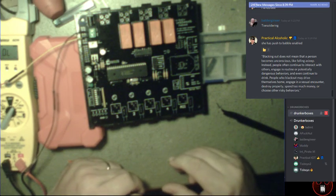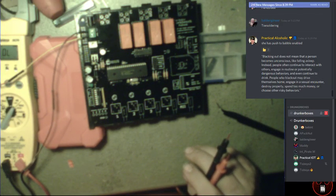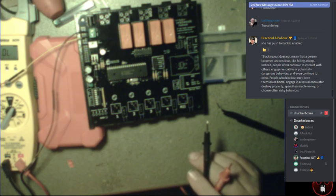And the antennas are based on the wavelength. So the longer the wavelength, the bigger the antenna is, basically. So an antenna at 1.8 megahertz might be 200 feet, whereas an antenna at 24 megahertz might be 15 feet.